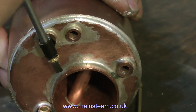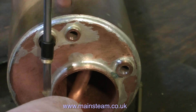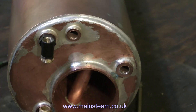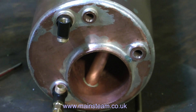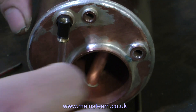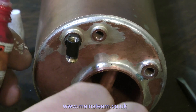What I'm doing here is using a screwdriver, which is about the same diameter as the glass tube, to align the two parts of the fitting. You must not put a lot of pressure on the fitting — it looks like I am on the video, but I'm not. Once the top fitting is aligned with the bottom fitting — which is just in there loosely — you can see how far the bottom fitting needs to go in or out. Just a tiny bit more adjustment was required. It's time now for a dummy run with the piece of glass. I'm doing this very wrong at the moment just to illustrate a point: if you look at the top fitting, you'll see the glass is too long and it's covering the hole through into the boiler. If you do it like this, the water gauge cannot function because one end of it is blocked.